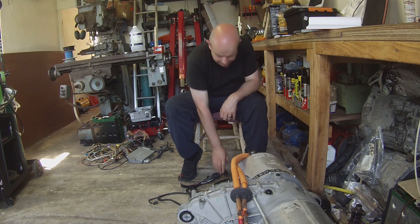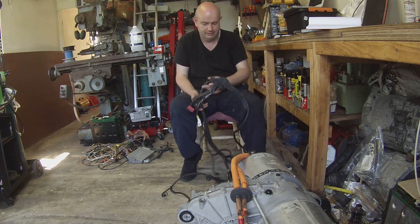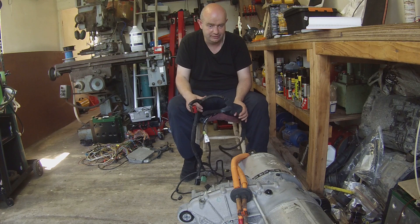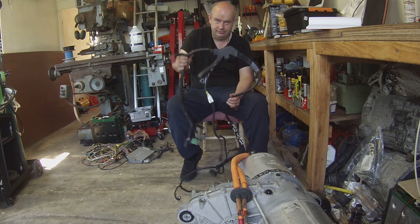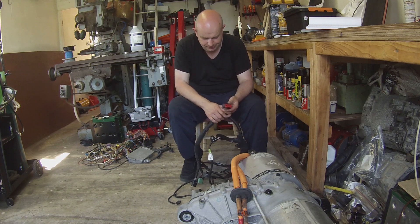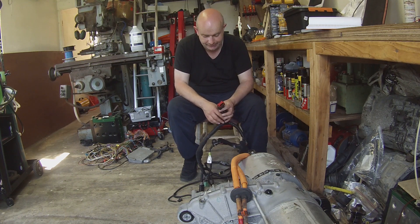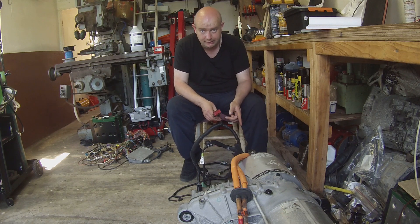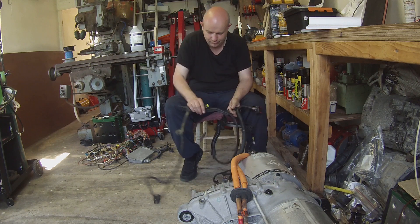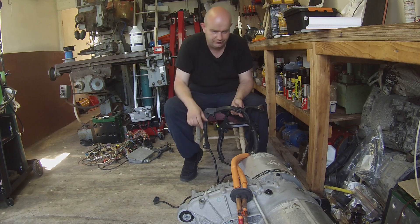The aim of the game is I've got this wiring loom here from the car, and what I want to do is strip it out and only have the connections that I need. There's a lot of other car-type stuff going on here. The two that we know we need is the 23-pin amp seal — this guy here which does all the signaling connections and so on to the inverter — and there's another one hiding down the far side.